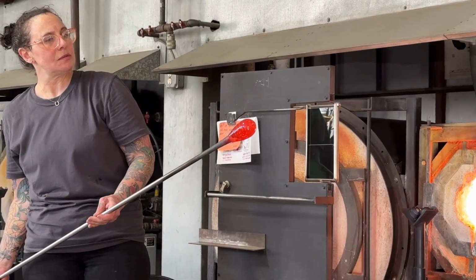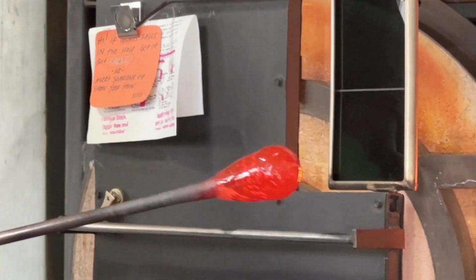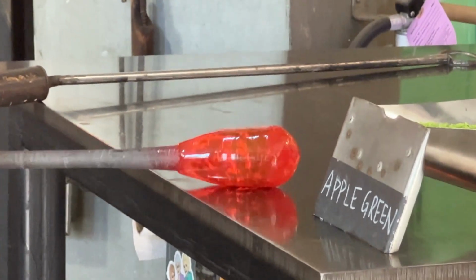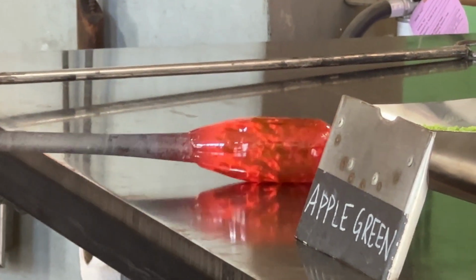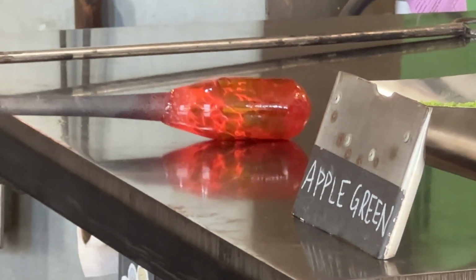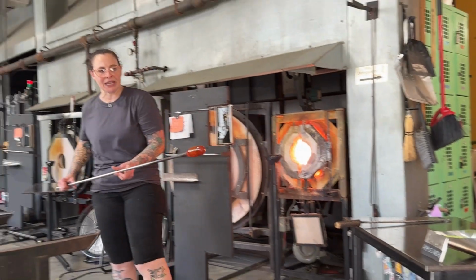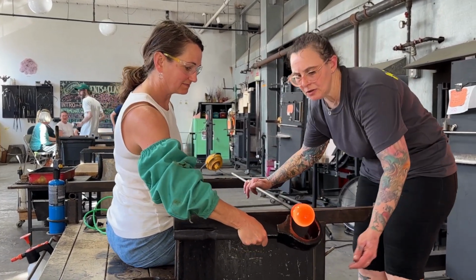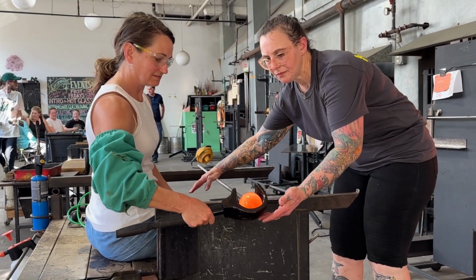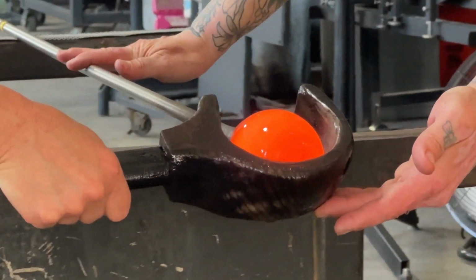Here, Jennifer is blowing a little bit of air in there and sealing off the end of the tube with her thumb, and that forces the air to expand and start the glass blowing. The way she described it to us, that glass blob on the end there, that's molten, is pretty solid when you first start trying to blow it out, and it requires a lot of pressure to get it moving. So they used a little bit of physics there: get some air in it, and then let the air expand as it heats up.